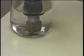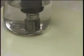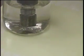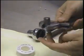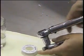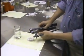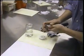And as we rotate it around, what you can see is with sufficient care, we were able to get a positive seal. Now to check under real-world conditions, maybe temperature cycling, adjusting the line to make a further connection, we'll back the fitting up only 45 degrees. A situation often encountered in industry. So very carefully here, we'll back up about 45 degrees, and now we'll connect again to the airline and test the sealing effectiveness.